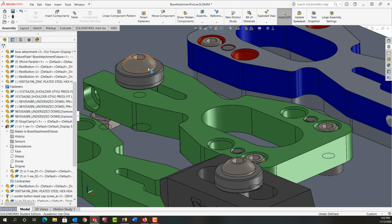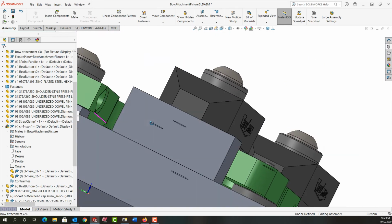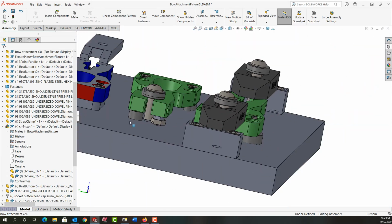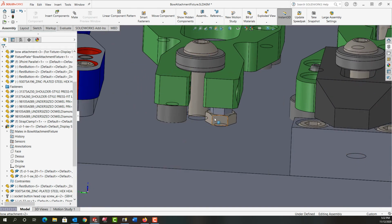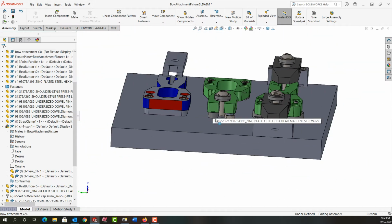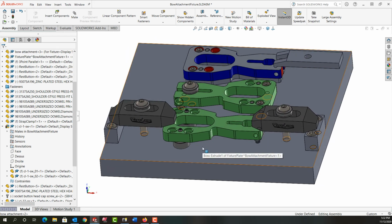So one option is to put just a regular socket head cap screw through some washers, through our part into our fixture, as close as possible to our supports here. Remember, we always want our clamping element over the supports or opposite the support, or as close as we can get it to the support. So thirdly, the other option we have is we could just go with two regular strap clamps as shown here.